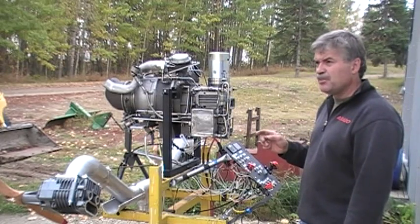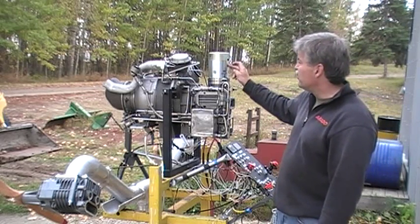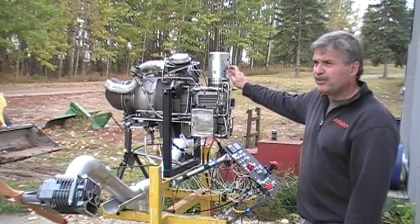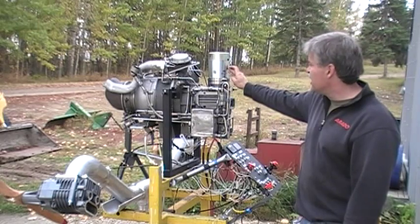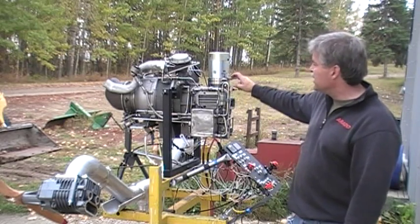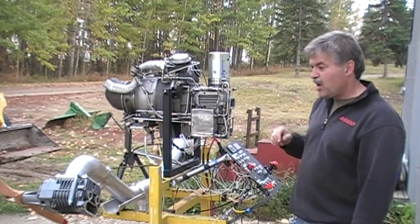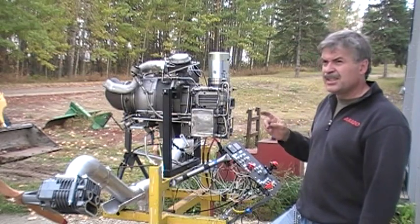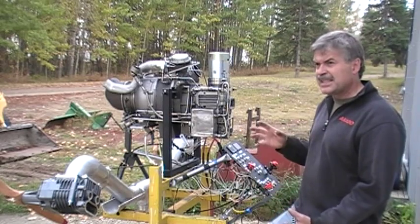It would be pretty difficult, so we adapted a 24 volt hydraulic power pack motor from Princess Auto, the aviation supplier of choice, and made an adapter coupling and a mount for the starter. Now, the question behind all this with that starter is that a starter generally just starts the engine and then decouples, and that's the end of it.